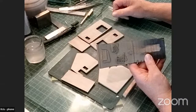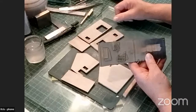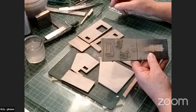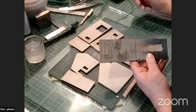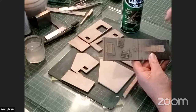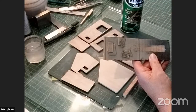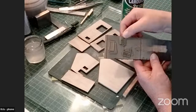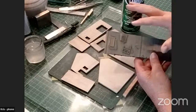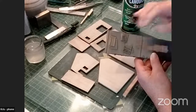These castings had been sitting in an alcohol bath for, I don't know, a week. I just pulled them off and threw them in there. That lets them clean a little bit. I then went through and sprayed them, without touching them, by the way. I used forceps to apply them to the double-sided tack tape. I just rolled some tack tape over and put it on here. But my point being is I did not touch them with my fingers because of the oils.